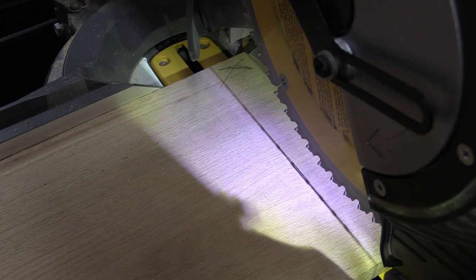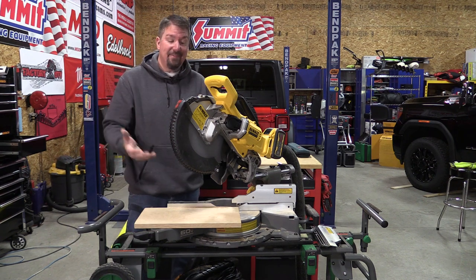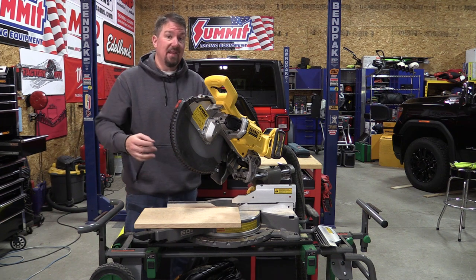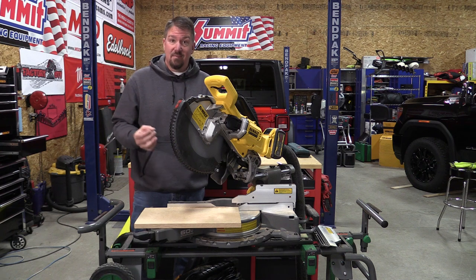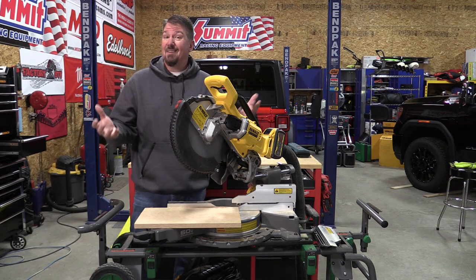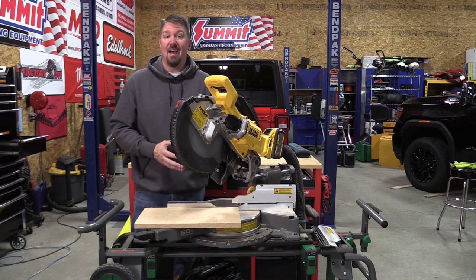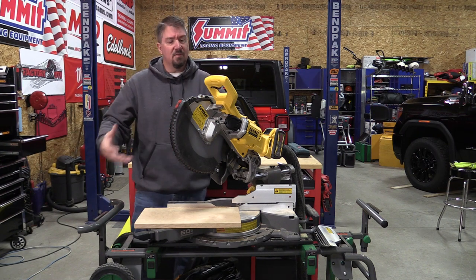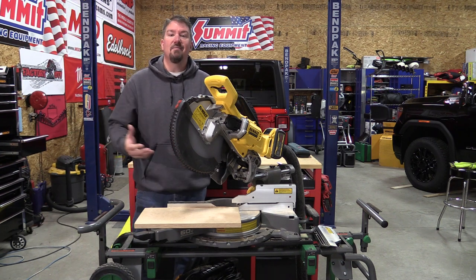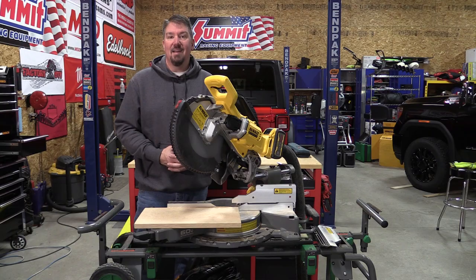There's a little bit of blade movement in this, but I don't think it's the actual arbor — I believe it is more of the blade itself. With the tools I have and the camera angles I'm able to get, I hope that gives you enough information to make up your own mind if this is accurate enough for you, and what you might be able to do to make it more accurate. This is a one-of-one unit, so it came this way out of the box — yours may come slightly different. From what I know and have seen out of DeWalt miter saws, most of them come almost spot on right out of the box. Let me know your comments and experiences down below. Give us a like, subscribe to the channel if you haven't already — have a great day.